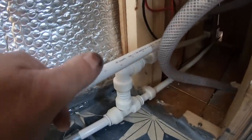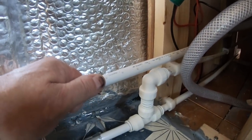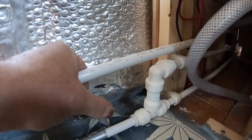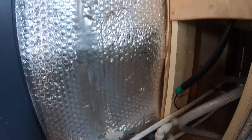So all that's left to do now is connect this. This is the hot coming from the rear of the boat. This will be the last point where it takes off for the shower mixer. So there's just going to be an elbow on there, down, and then across, because then there's going to be a takeoff for the washhand basin that's got to be installed in this area